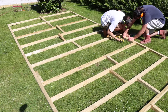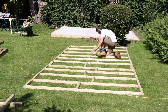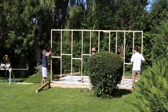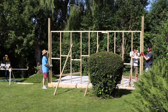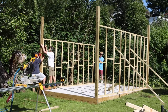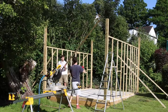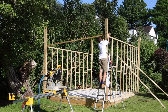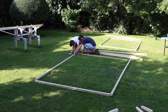The first thing I'm doing is making the front and back wall. The roof is just a single slope roof, so one side is higher than the other. The highest point of the timber store is the front at 2.4 metres, and it slopes down to 2.1 metres. It doesn't need to be the steepest of slopes — as long as the water flows off the roof, that's good enough. I'm putting everything in position temporarily, with a couple of 2x2s at 45 degrees to keep the wall up, and screwing the fence post into the corner. This is a really easy way of constructing a shed — make four walls and have the corners made out of fence posts you can screw directly into. I haven't cut the posts to size yet because I wanted to mark out with a roof beam exactly where the top of the roof needs to be. I put the beam in place, traced with a pencil where to cut the fence post, and used a bevel gauge to mark the angle of the roof so I can make the left and right side walls with the slope in them.